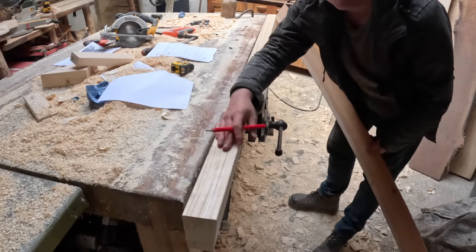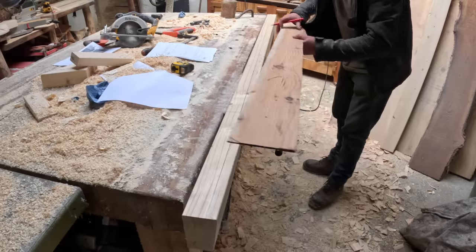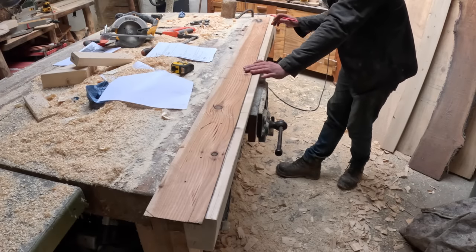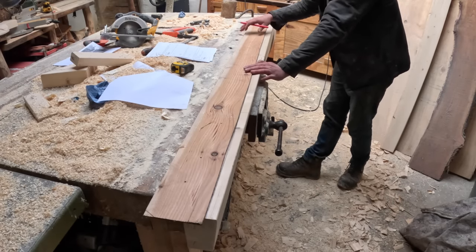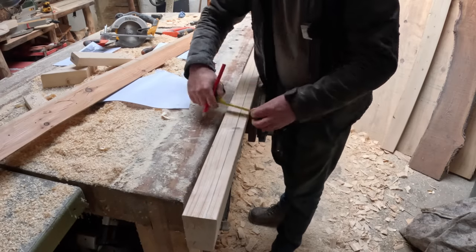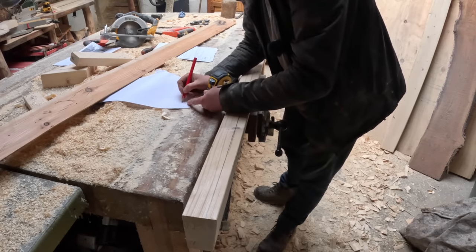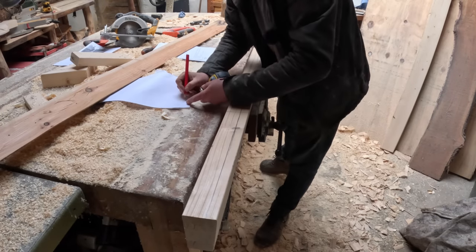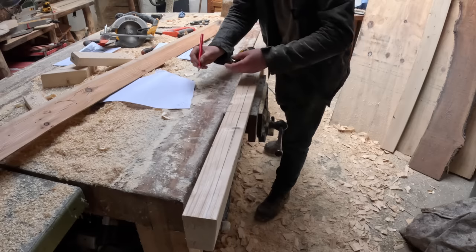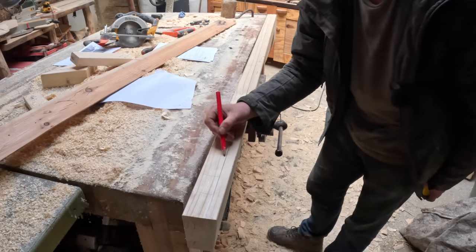This is the leading edge and this is the tip, and I've just selected the thickness I want at the tip. Then I'm drawing a taper along there that I'm happy with. I'm going a bit thicker than I have done in the past because they're a bit longer and I want them to be a bit stronger. I've taken measurements down from this edge: 20, 20, 24, 24, about 26, 30, 30 and 34. So now I can keep them consistent - mark that on the other side and then all of this wood is going away.